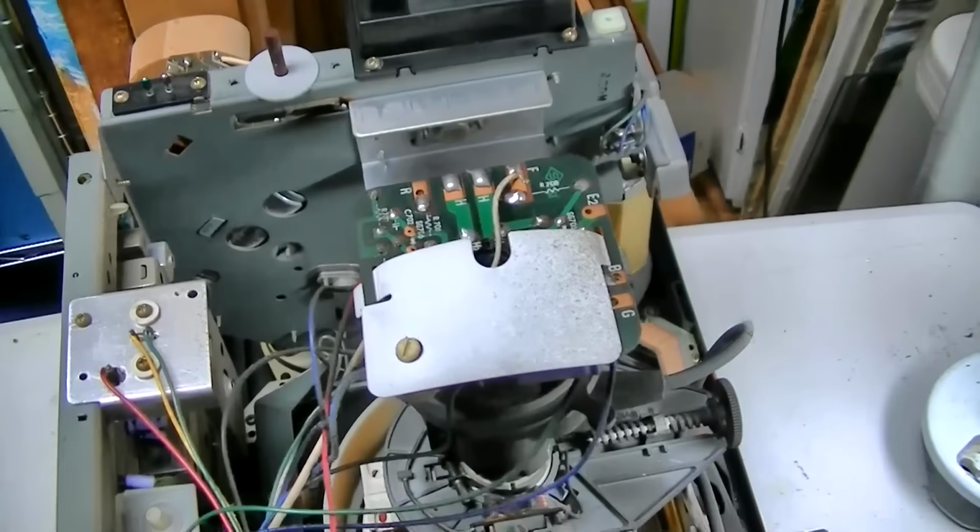Now the spacing on these leads isn't quite the same. It's a physically smaller capacitor. So I'm not going to ram it down any lower than that. I'm going to bend these over and reconnect them and solder them. I can do a much better job without a camera in my mouth and having to worry about, yeah, so that's sort of what it should look like.